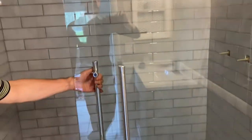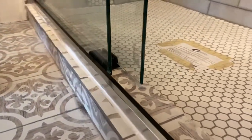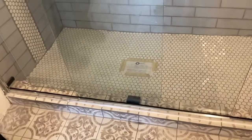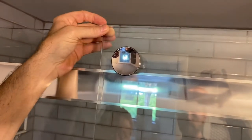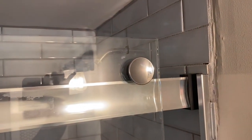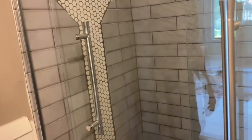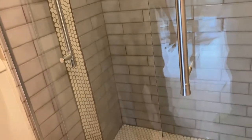This side as well. They give you a guide down here — that's what helps guide these doors. You can see that guide in there. Now I do want to mention something very important: when you get these, there's gonna be some plastic pieces on your corners that are taped on. Do not take those off until your doors are completely installed and you know for sure that's the way you want it. Those protect the corners of the door, and if you set this down without that plastic piece, you will chip the corner of this door.